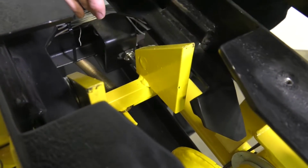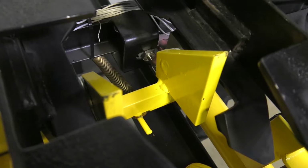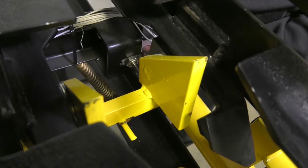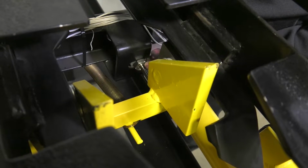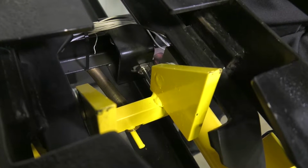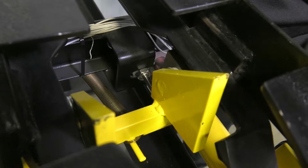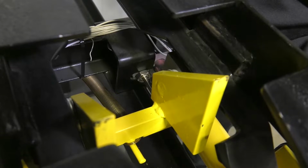And very importantly, make sure to lubricate the shaft of the call-up cylinder. This should be done at least weekly, preferably a little bit more often than that, and that can be done just by spraying the shaft in the extended position with some fluid film.